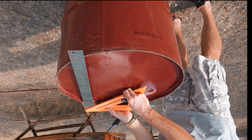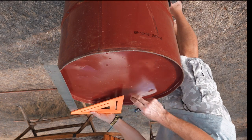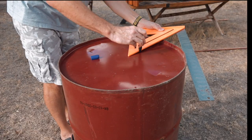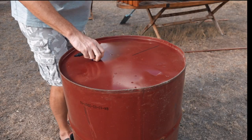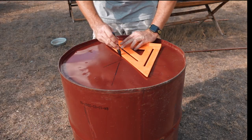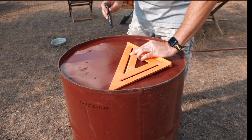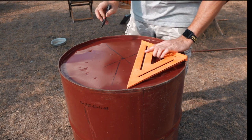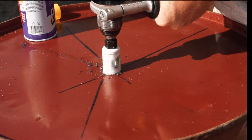Now it needs a drain. I want it at the bottom. Well, obviously at the bottom, but I mean at the bottom, not at the side. I need to drill a 1.25 inch hole right in the middle. And then I can install a brass bulkhead tank fitting with a 3/4 inch female thread. It's amazing what odd stuff Amazon has in stock for same day delivery.